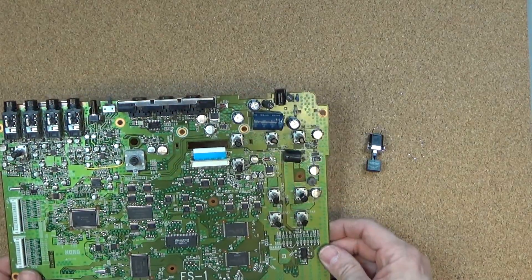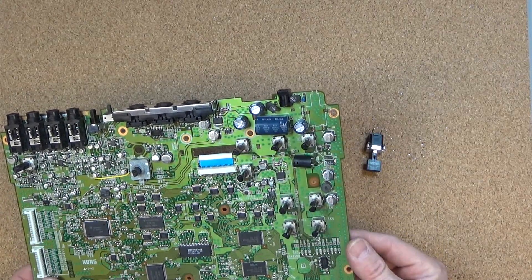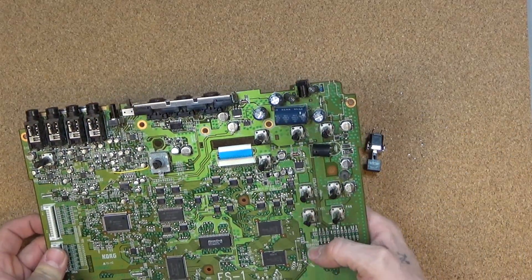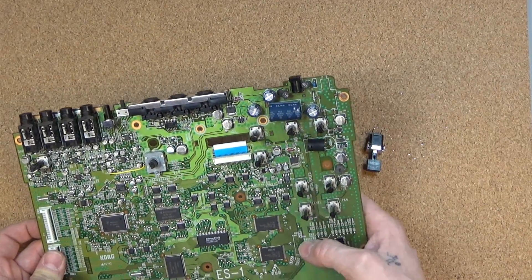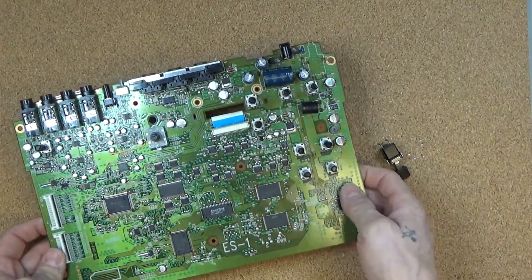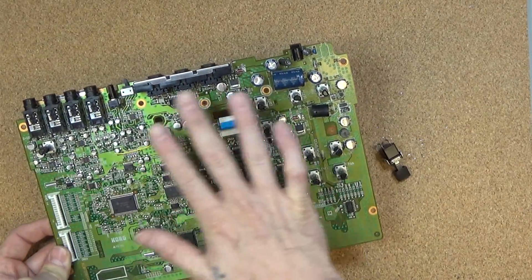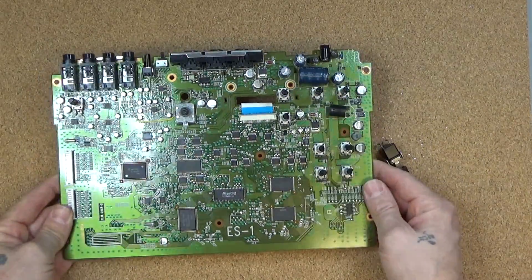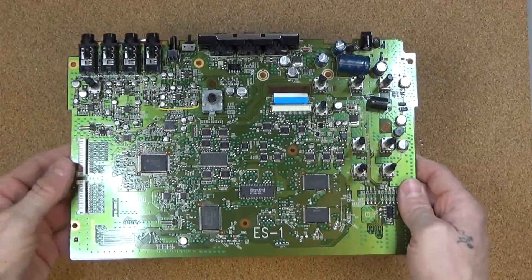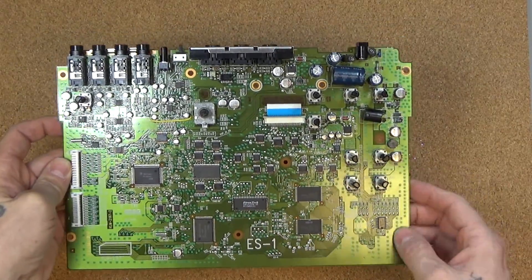So then I decided to power it up. It's nine volts — I had to actually look that up because one of the things that happened was I lost the power supply. And so that's a big indicator of maybe that's what the problem was. I was testing around, I hooked up nine volts, and I kept getting power all over the board in what should be the flooded ground plane. And I was like, okay, that is not right. I start probing around some more and sure enough, everywhere — all these little vias I was using as test points — all of that flooded area was getting nine volts.